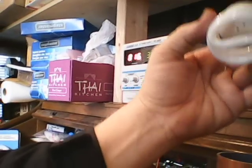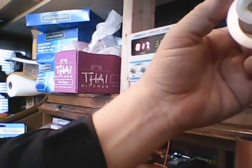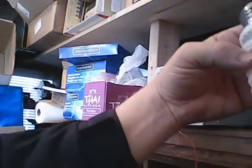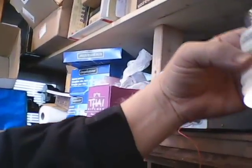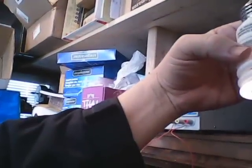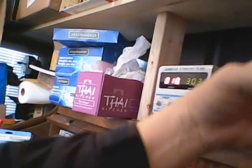Now let's light up a little compact fluorescent light and watch the power draw as we light this up. Try not to touch it — it's a little tricky. With my left hand here, you can see it draws a little more power, especially when the wire touches. So from 17 milliamps, if I don't touch it, up to about 19 milliamps.